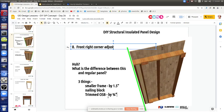Half an inch is big, so we should also cut one that's a quarter to have that kind of adjustability. And the rest is you seal it, like caulk, expanding foam, but screwed in tight, so we're tight. Top plate bonds it together. Also, on the outside there's a strip of OSB that ties it together.